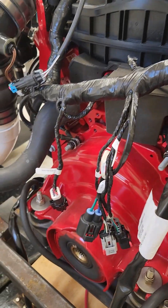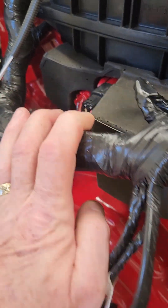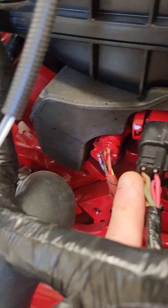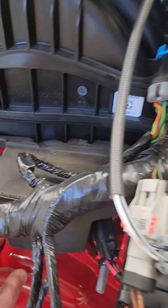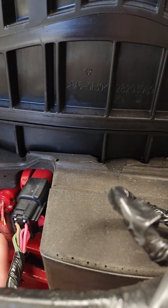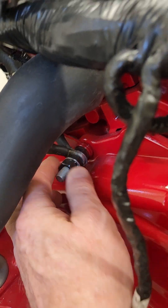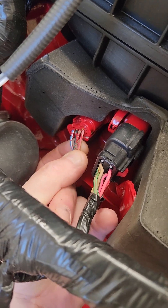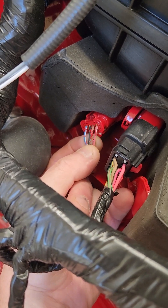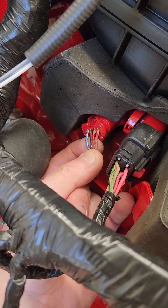All right, so we're going to be looking at the actual back of this GXI engine. It's in the lab, not in a boat, so it helps. Being a Gen 5 engine, I wanted to show you the connectors on the back of the engine. From the back, this is the back side of the engine — top of the flywheel housing, just a little bit on the left or port side. You have your ground stud over here with the grounds on it. Always make sure those grounds are clean if you're having problems. So this is the fuel pressure sensor, and in this application this is an early model engine — 2014 to 2016. I think it changed in 2017.